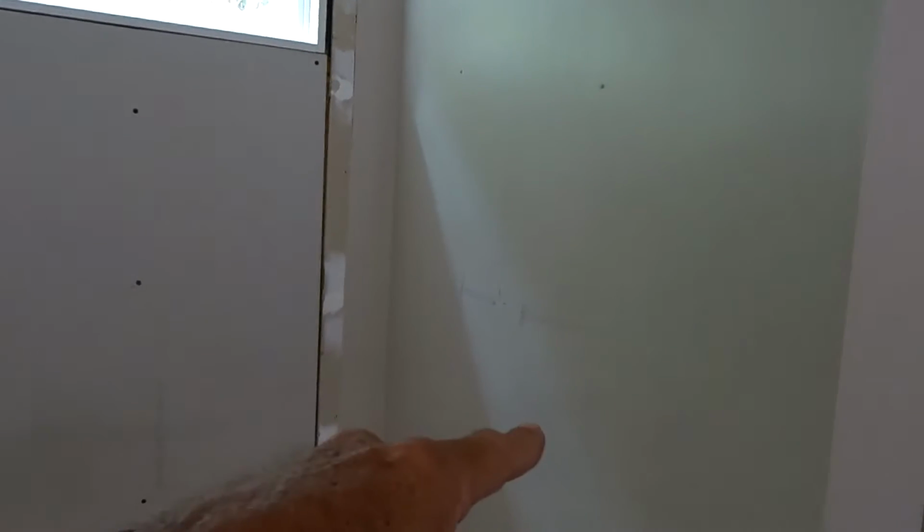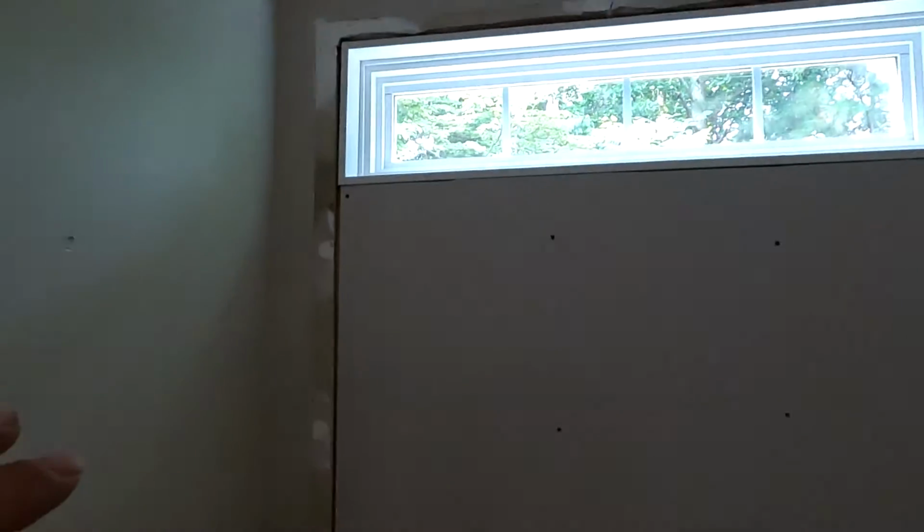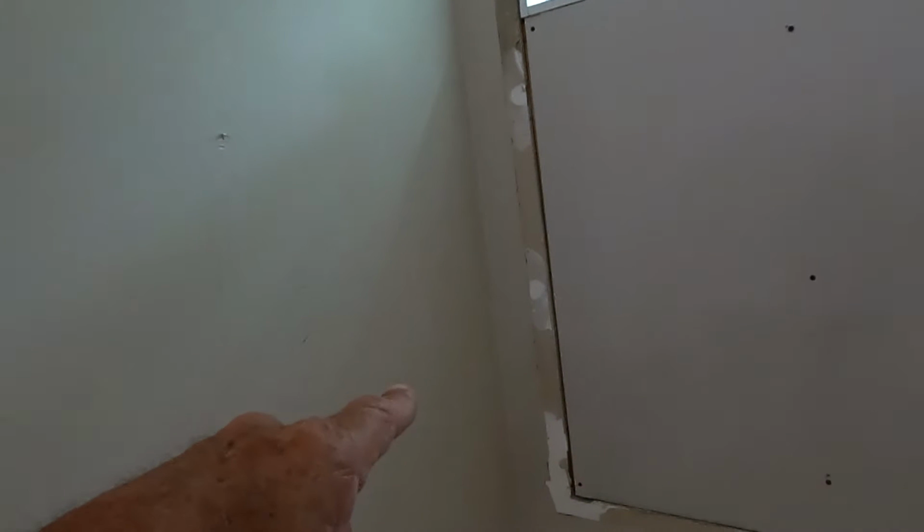So shower head, slider, and then the third port will normally go through the wall, but there's a lot of studs and all that stuff, and there's an attic upstairs. So I'm going to run the third port up into the attic and over and down in order to have the slider over here. A shower head. Yeah, there's going to be a shower head and a slider.